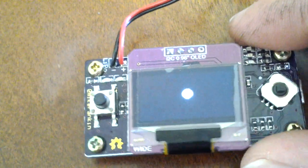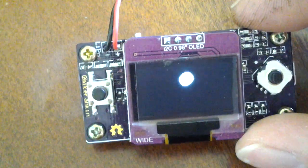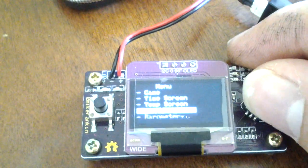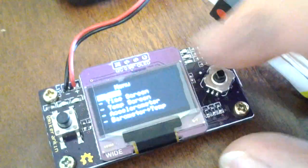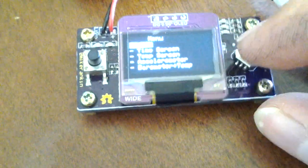On the accelerometer display, I added a little circle that grows bigger as you shake the board. I still have to play with it more. My original intent was to build the GPS on this board, but unfortunately — even though there are expansion pads — all I could do was read the data, and the board was almost at full memory, since this little ATmega processor only has 20K of available memory. So I'll probably just make it a remote temperature sensor or a thermostat for another project.